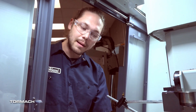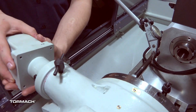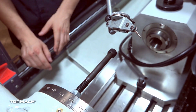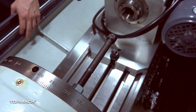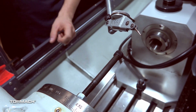Once we've established that line in a good position where we think the worm is into the gear, we want to start checking our backlash. I'm going to rotate my worm into my gear and lock my eccentric lock on top here — nice and snug. Now I'm going to rotate my fourth axis counterclockwise, then move it back clockwise to a good position where I can engage my indicator. I have now removed the backlash from the fourth axis.